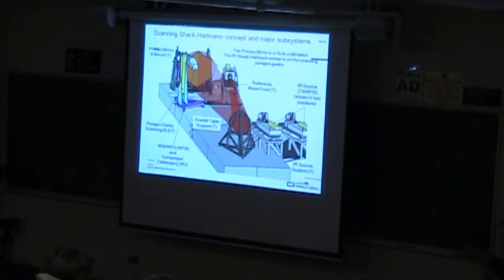And so by spending a lot of money on this metrology equipment, the idea was that if we could test it in that ground stage, we don't have to do anything to prepare it for testing. We just take it out of the grinding tool, put it in this tool, test it, and in one day we can put it back. So this speeded it up. By the end, the cycle time was 35 days. And by the end of all 18 mirror segments plus one spare finished, it was a 2-year program, which still included the development of the testing apparatus, but was still shorter than if they had just gone ahead. Unfortunately, we now have 2 of these systems sitting there at Tinsley. They're obsolete because they were very custom designed for this purpose, but they might be used again for something else.